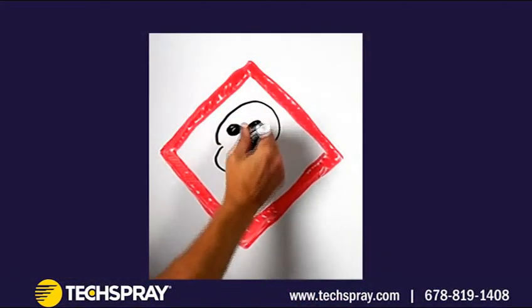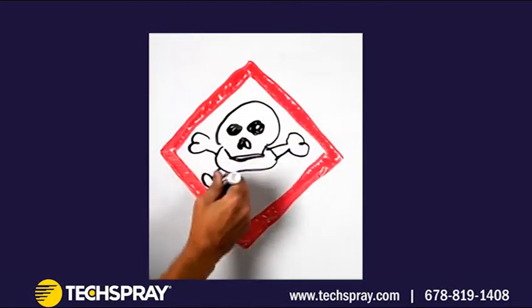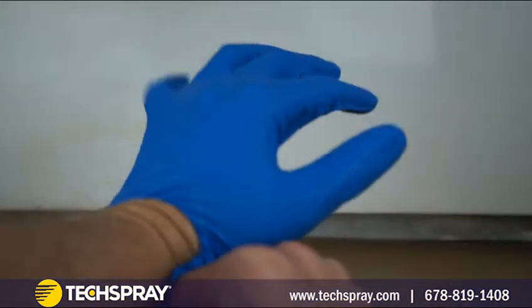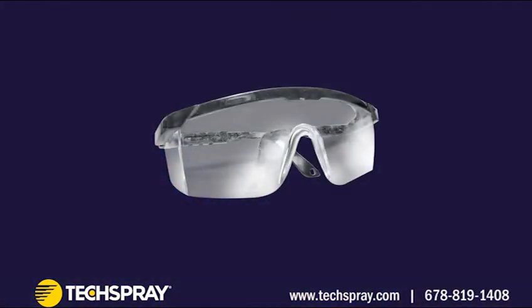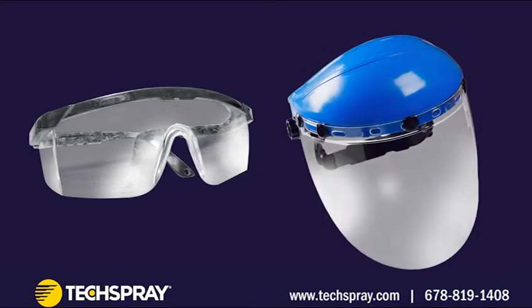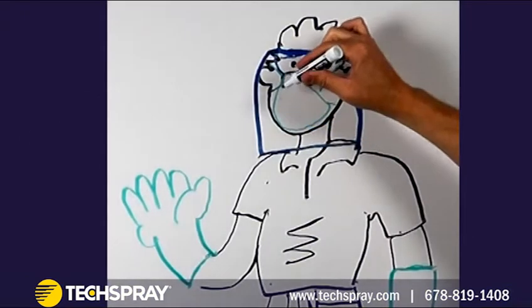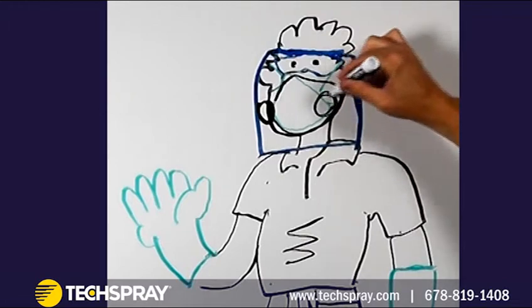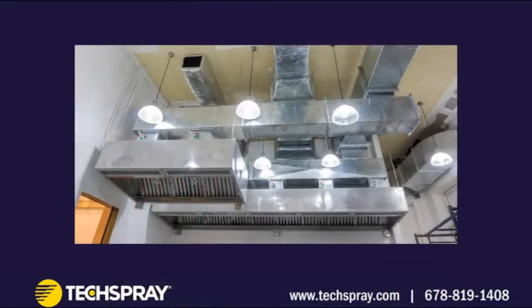Many of these solvents can cause health issues if exposure is too high over a prolonged period. Use gloves made of solvent-resistant material like nitrile, and safety glasses or goggles to keep the solvent out of your eyes. Consider a face shield if you plan to do a lot of scrubbing, which will also keep the solvent out of your mouth and nose. Additional safety equipment and garments might be needed depending on the expected exposure level. You will also need very good ventilation to draw the fumes away from you.